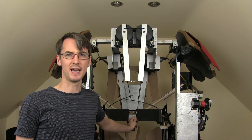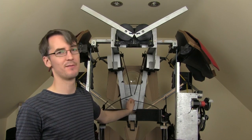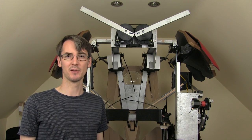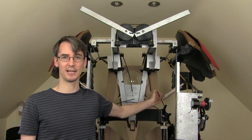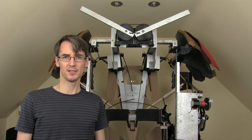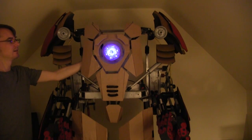The next part of the mechanism is going to be some sort of solenoid release that lets go of the cables. The idea is that it would be latched down, and when I want to get into the suit I can remotely release the catch so the back opens. When I get into the suit I manually re-latch it, and when I want to get out it unlatches — or if there's an emergency I can manually unlatch it, so I'm not reliant on an electric system to let me out. I'm not going to do that this time though — I'll make another video in the future covering all of these cable ends, including a pair of cables to release the ankles, a pair for the knee latches, and possibly an electronic option in there as well.